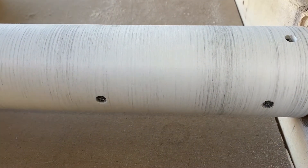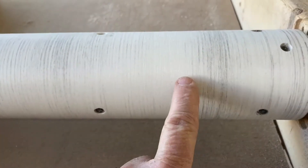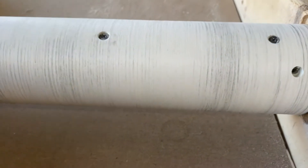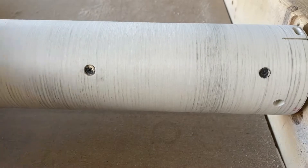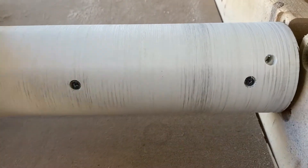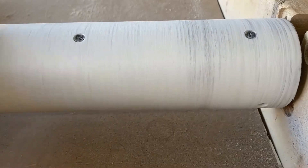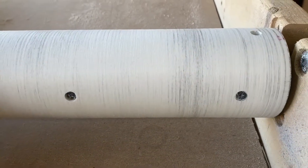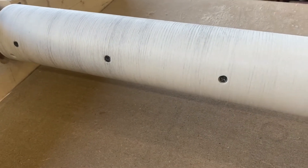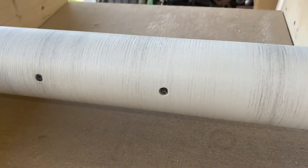You can see where the low and high spots are. This is a high spot because the pencil marks are just about gone. This area is a little lower, but I've already worked on this a little bit so it's in pretty good shape — getting really close. I've used coarse sandpaper and I'm going to do a little finer now.